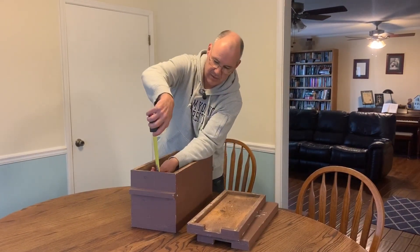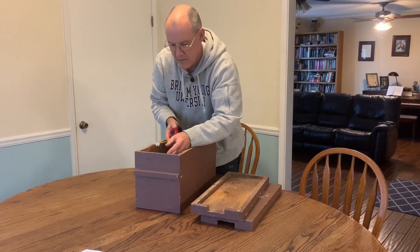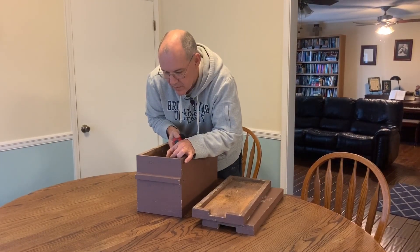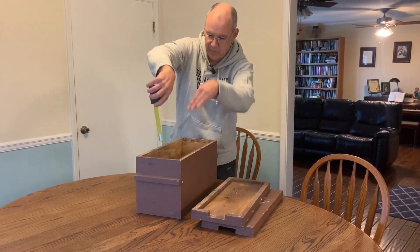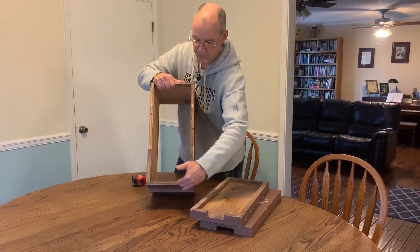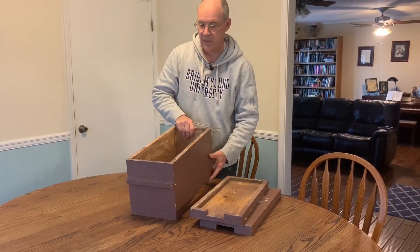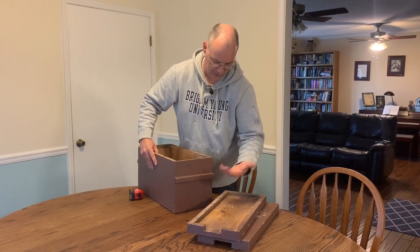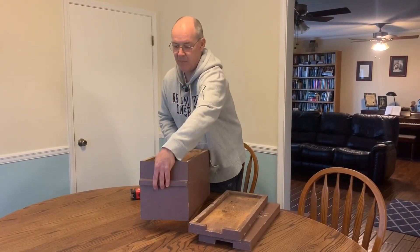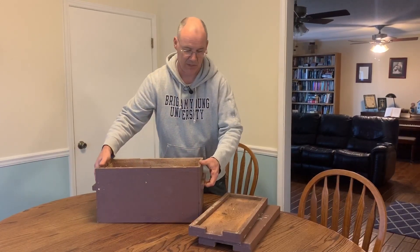To hang your frames you need to make a notch — it's cut three-quarters of an inch deep from top to bottom and three-eighths of an inch wide. That leaves enough board thickness to keep it stable but gives you enough room to hang your frames. Then you can cut some strips of wood for cleats. It doesn't really matter what type of wood — just something to grab hold of. They work better on the ends rather than the sides, because putting them on the sides becomes very awkward when you're trying to move the boxes around.